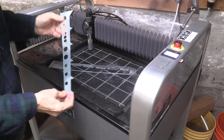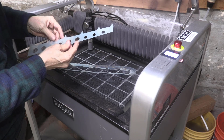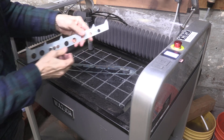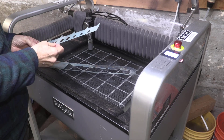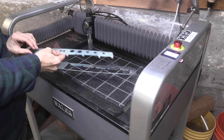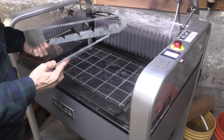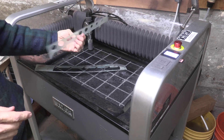So here's the finished piece, and of course the piece is good from a dimensional standpoint, although it does appear to have delaminated a little bit. Although it's distressing that this happens, it wouldn't happen in a solid material, but it does happen in this case for sure. And I don't know whether to blame the water jet or blame the material itself.